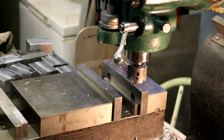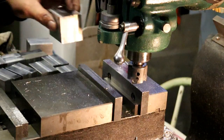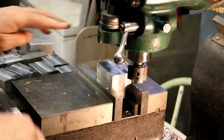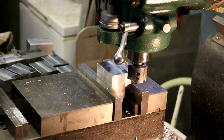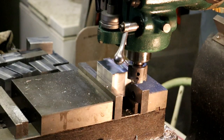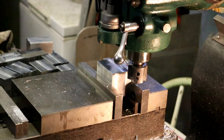I'd say a couple hundred thousandths. So we got 135 thousandths, 135 thousandths to take off. So we can put it back in there. 135, so that would be 50, 100, 10, 20, 35, and set my 0.